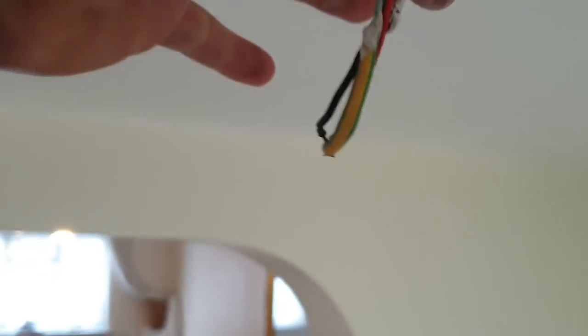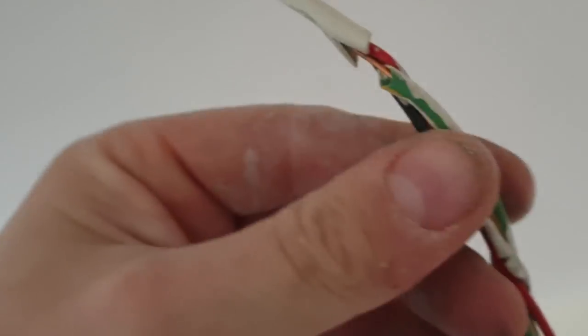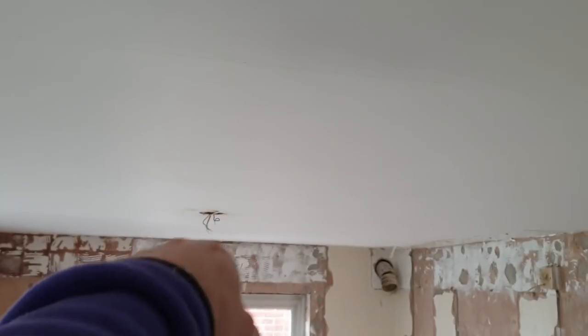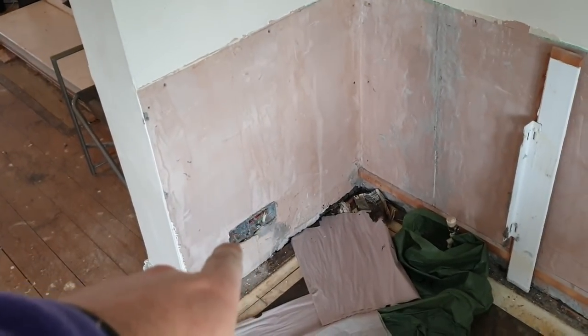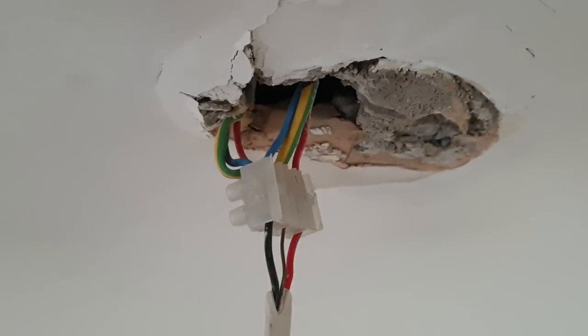So I just found this in this ceiling. It's just that sticking out originally. Makes a little bit more sense. I couldn't work out why there's only one wire here and one wire sticking out over there. Fortunately, all this is gone now. It used to be fed off a fuse spur down there, which fed the switch and then fed all these lights. But that's dead now. We're going to have a designated kitchen lighting circuit that we've run from the fuse board. So this can all get cut out. I'm just trying to work out which way the joists go so we can put our downlights in.